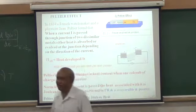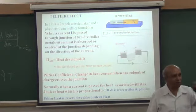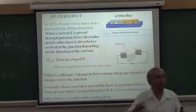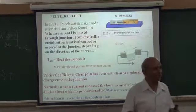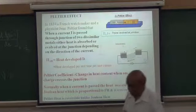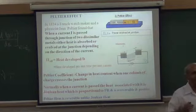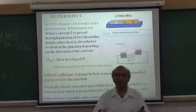And with semiconductors, the beauty is you can dope them either as N-type or as P-type. The Seebeck coefficient in semiconductors is negative for N-type and positive for P-type. In semiconductors we have no problem; the sign of the Seebeck coefficient is very clear. For N-type, it is electrons, so it is negative, minus 200. For P-type, the conduction is through what are called holes, the vacant states in a filled band. These holes behave as if endowed with a positive charge. Therefore the thermoelectric power, or Seebeck coefficient, is positive.